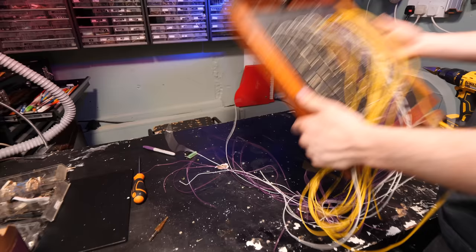There's also these two blue wires here. These connect to another piston, which is under the swell keyboard. And this button, I'm not sure what it was used for. I think I might turn that button into an all MIDI off, like a MIDI panic switch, which basically turns any stuck notes off.